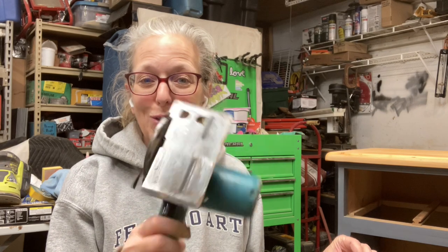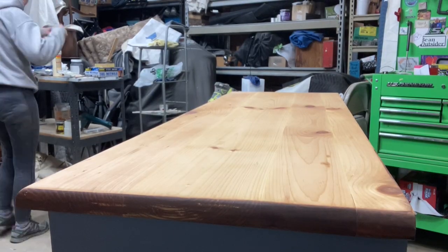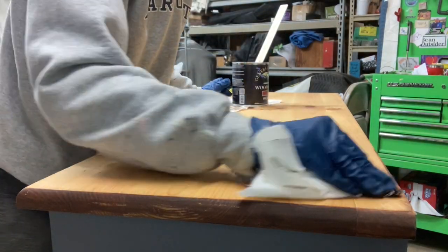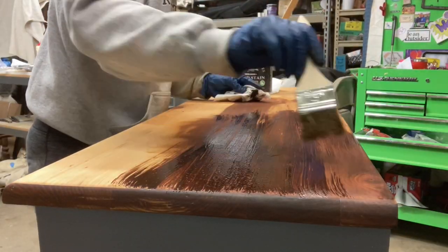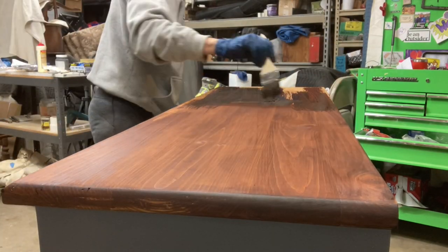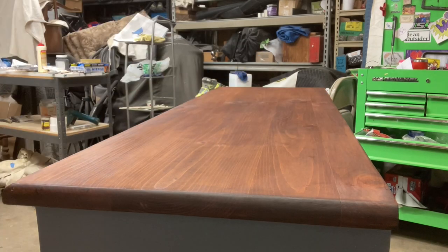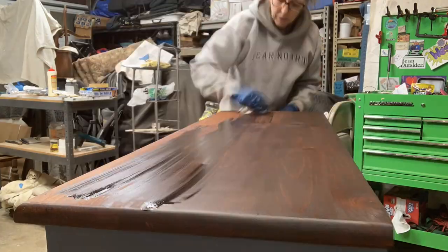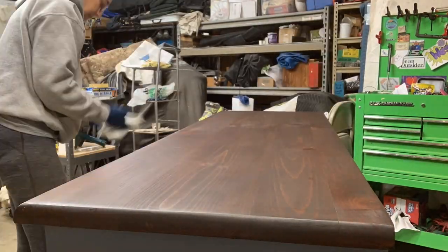I'm using a little old circular saw — it's kind of janky but it worked and was much easier than the oscillating tool. I'm applying the Hickory water-based stain first and it went on much nicer than the first time — very few swirlies. After the water-based stain dried I put on the Java, which is the oil-based gel stain.